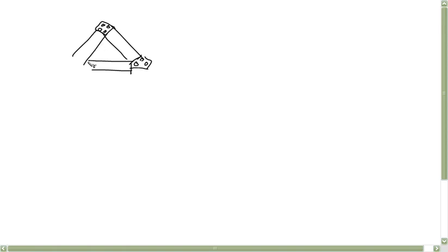So why do we learn to do trusses with pins at the members? Because if you're expecting your joints to apply couples to hold this thing together, those are going to get ruined right away. So say instead of building a truss like this, right now you could put pin joints here at these three joints, right? And it would be determinate and you could calculate the loads and it would stay static, right?